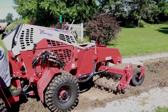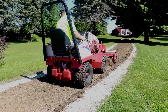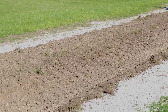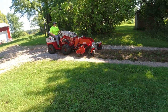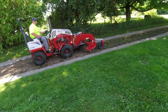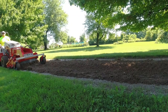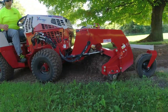So this thing was packed really well. We had some rain the night before, which was great. You always want, if you can, to work with a damp driveway because the gravel just works up so much easier. You can see it goes from light to dark because I'm churning up that gravel — it's just an amazing transformation on this driveway. I can't wait for you guys to see the before and after pictures. The biggest issue with this driveway was the grass in the center. I had to go over it several times to dig it all out, get it up by the roots so we could then remove it.